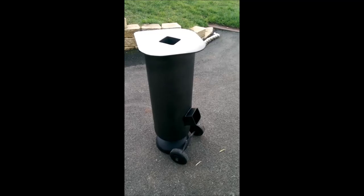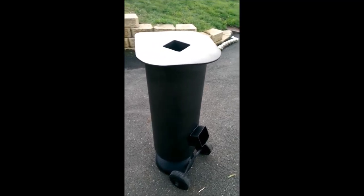There's an air compressor tank on the outside. I cut the bell end off one end, connected it again down the bottom, just re-threaded the bung in one end back into the other end, so the bung is actually between those two pieces, and then just spot welded it a few times. I used the wheels again. That's the casing of the air compressor on the outside, and there's a metre of four-inch tubing which acts as the burn chamber.